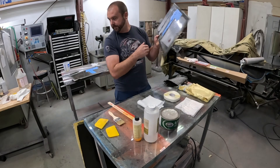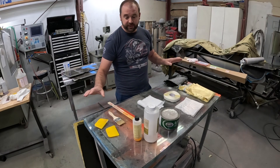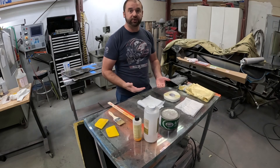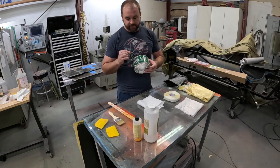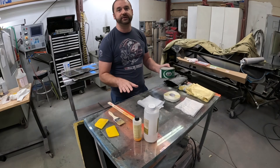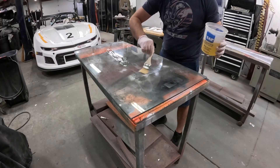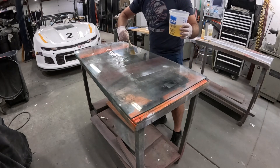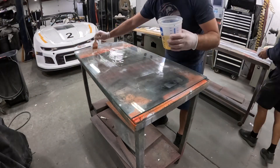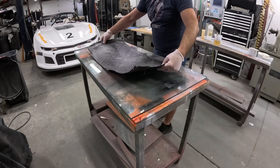What we had to start with is a working surface — we used a retired coffee table's piece of glass as the bottom portion of our mold. We also had to put on a little bit of mold release to get us to the point where we started this montage. At this point the mold release is on the glass and we're adding the two-part epoxy to the glass itself, which is going to make sure that that side of the carbon is wet when we put down that first layer.